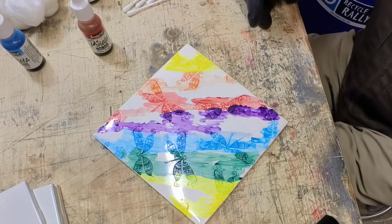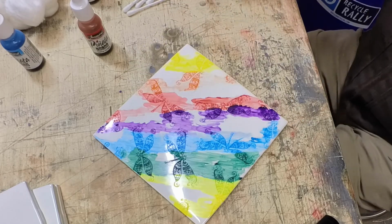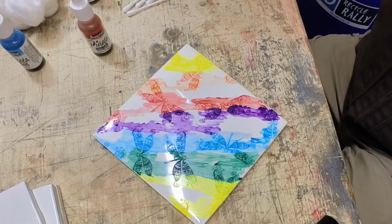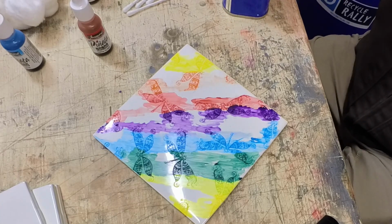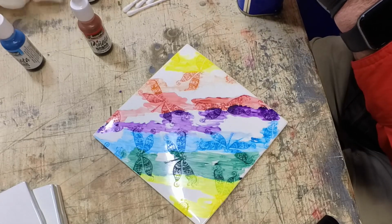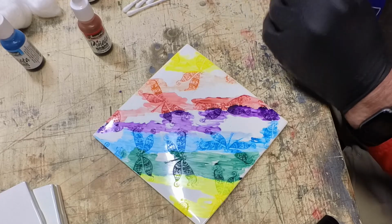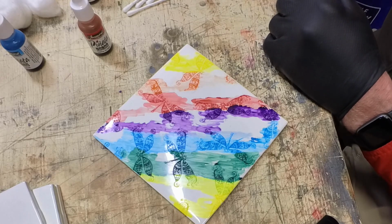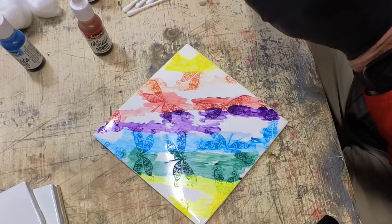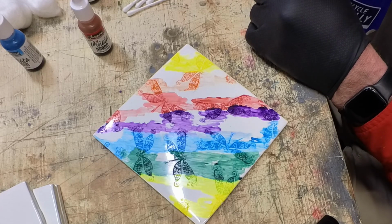Okay, so you can see here I've got my inks spread over there. They dry really fast. It's one of the reasons I really like this alcohol ink. Even when I'm staining wood, I can go from applying some as a stain to cutting within just a couple minutes, maybe 5 minutes at the most. So it's a lot faster than an oil stain. Sometimes I do follow that up with a clear coat when I'm doing the wood. Actually, I always do. Pretty much always do, I guess.